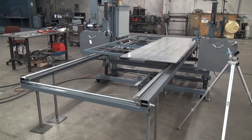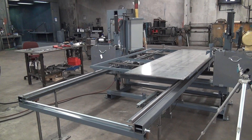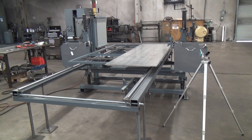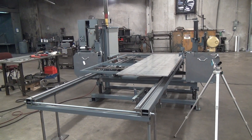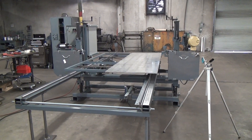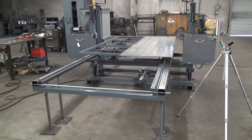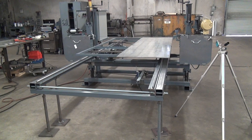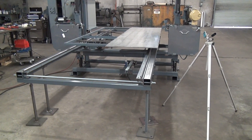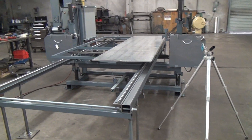So the upgrade is to go with a rack and pinion table drive mechanism. The saw I've got to illustrate that today is a variant of a model 480P horizontal blade travel table bandsaw. The 480P comes with a lot of table options: a fixed table where you slide the workpiece across, a manual traverse or hand-pushed traveling table, or a powered traveling table. This is the latter, and it has quite a few interesting options, but we're going to focus on the table drive system for this video.